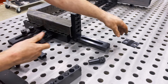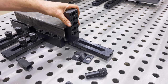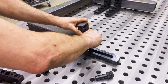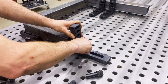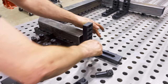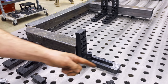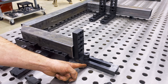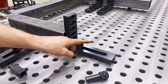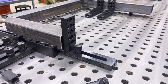I've done it by adding this — this is the tooth washer. It simply goes in the holes and on top. Now what happens when you tighten the bolt down — I'm just going to do this with my hand, not even going to use a wrench — now it's impossible; no matter how hard I hit it, this cannot slide backwards. These teeth are on eighth-of-an-inch increments, which allows me to precision locate where this stop is, especially in relationship to others.